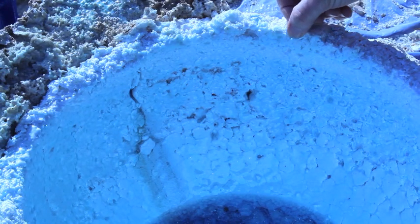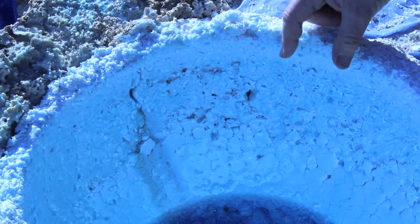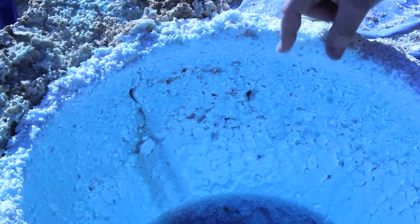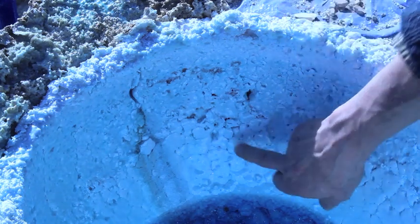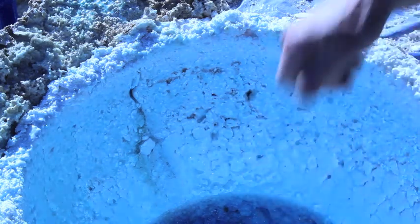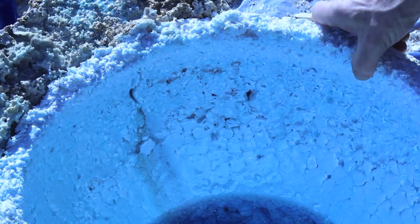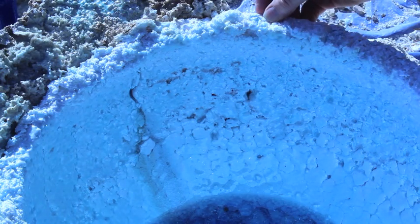I haven't done the numbers yet, but it's close to 70,000 pounds I melted in this pot - so 35 tons came out of this pot, and that's pretty good. There are little flaky pieces coming off which tend to flow down; they're a little bit heavier than the glass so they go to the bottom, but I still have to pick out stones now and then. Overall it turned out pretty good. Now that I'm rebuilding it, I don't think I'll make any changes - I'm kind of happy with the design and don't think it needs any modifications.